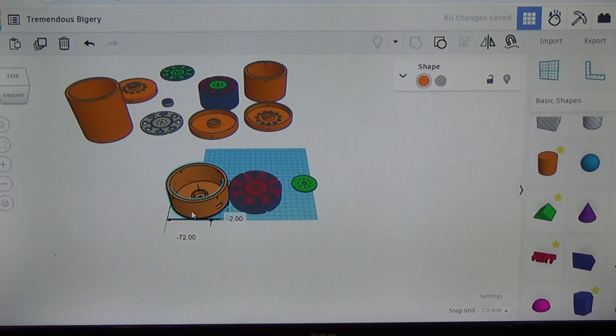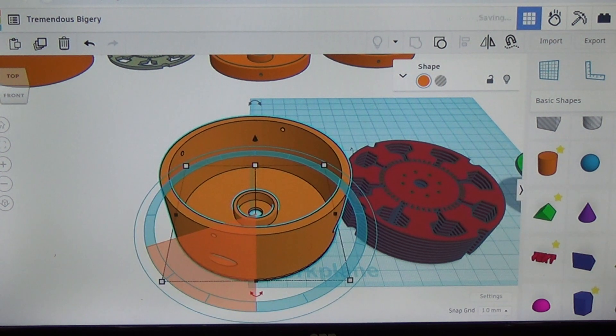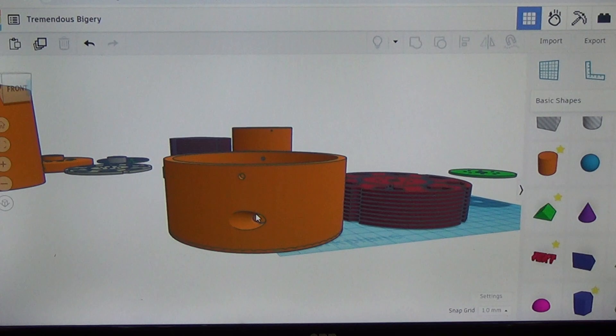This case has got the bearing holder — you can see the bearing holder in the bottom right there. You can see one of the inputs on the back and another one on the side. It's a flared opening going in, narrowing down to a smaller hole. What this allows me to do is change the angle of impact from a really steep angle to a very narrow angle, because tuning the impact angle of the hydro flow into the turbine is pretty crucial to getting it to run just right.